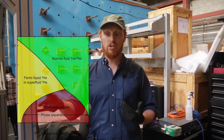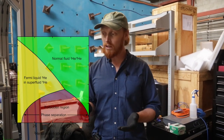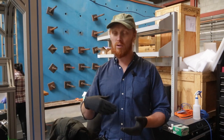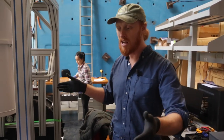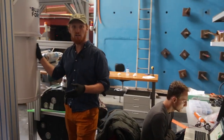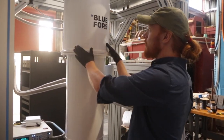It has a mixture of helium-3 and helium-4, which it uses to cool down. The base temperature we're hoping to get to today for the commissioning is below 7 millikelvin — that's 7 thousandths of a degree Kelvin, or somewhere in the neighborhood of negative 460 Fahrenheit. In order to do that, we need a number of fairly complicated pieces of machinery, but the heart of it is this unit right here, which doesn't look like much right now because it's closed and under vacuum.